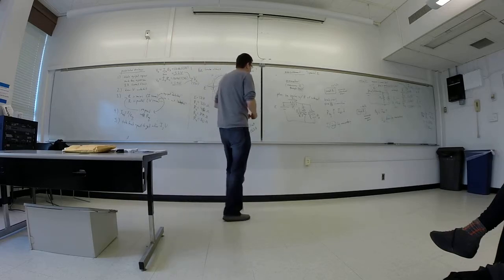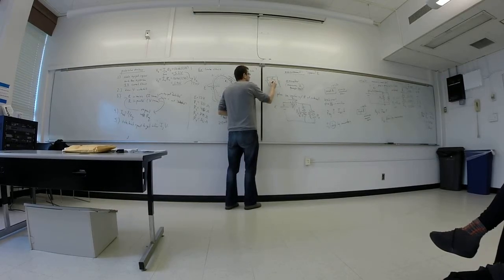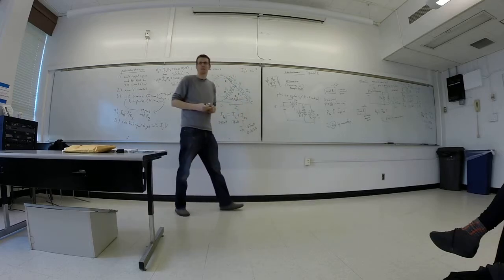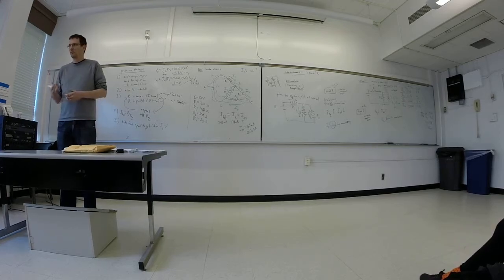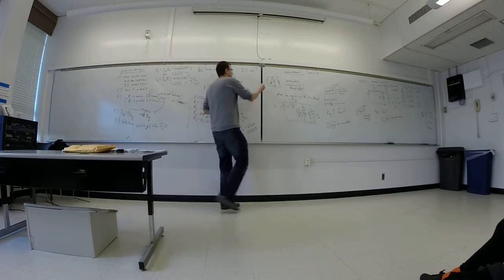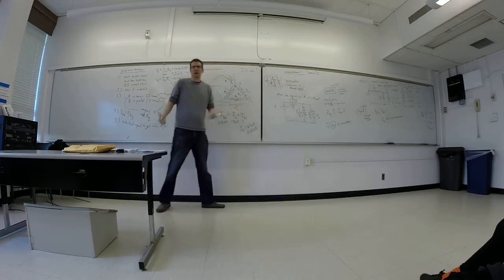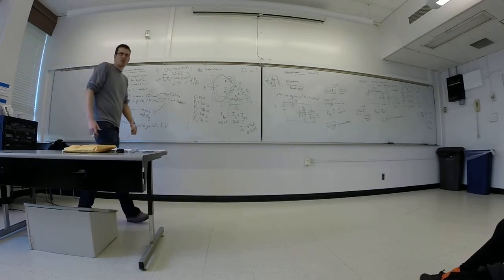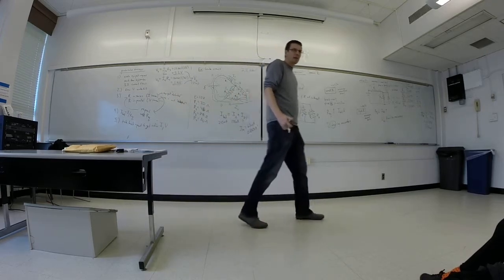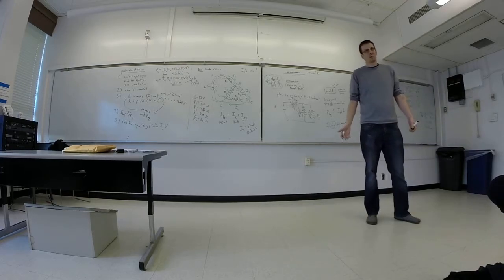My favorite one, by the way, is something like this. So I have a circuit like this, and someone puts an ammeter like this by accident. What just happened there? I basically short circuited the power supply. I basically taken this equipotential and this one and just put half an ohm between them. Massive current surge. You would probably trip the circuit breaker in the whole lab, except the ammeters thankfully have fuses in them. Okay?